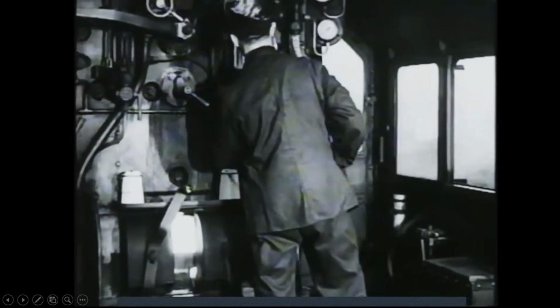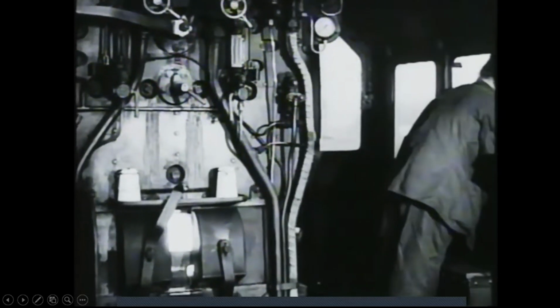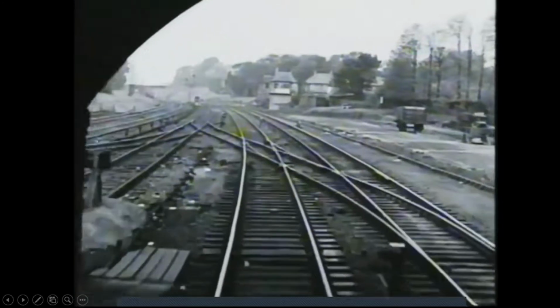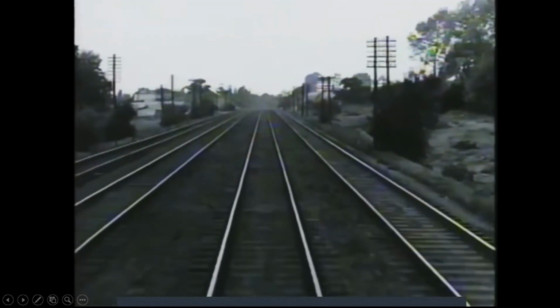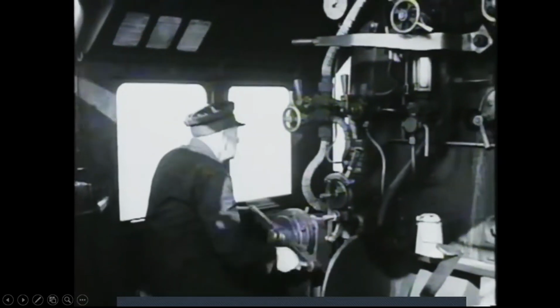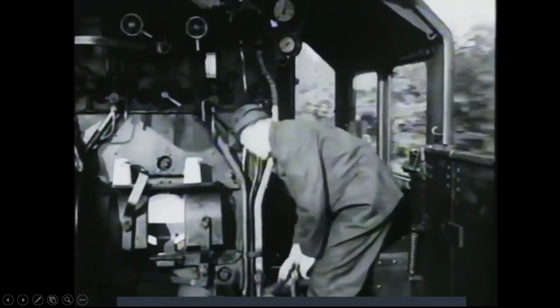When the locomotive is working hard, air is drawn rapidly into the firebox, and too much secondary air can cause problems. As cold air is drawn in through the firebox door, it can sweep the hot volatile gases through the boiler tubes before they have completely burned and released their energy. This is wasteful and also results in black smoke at the chimney. Cold air hitting the red hot metal of the boiler tube plate can cause distortion and serious damage. A wise fireman balances primary and secondary air based on the needs of the locomotive.